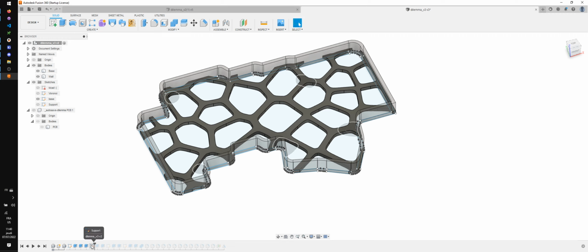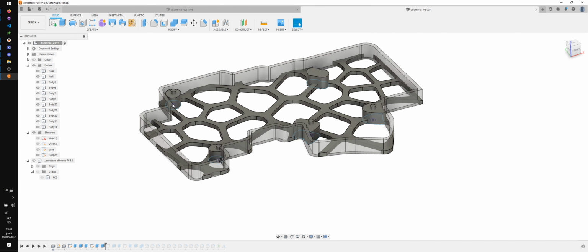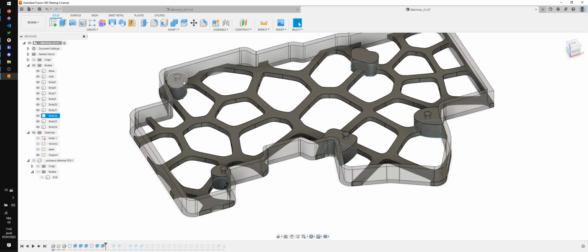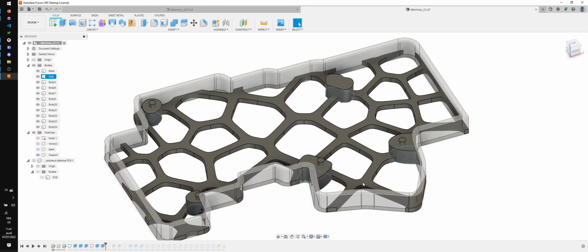All right, then new sketch, which is called support, and that is for those. All right, so there's a few things I don't like here, which is when I was installing the PCB, you have to press on specific points, which is 1, 2, 3, 4, those 5 points. So it's not super convenient. And also, it means there's only so many supports. And when you type, there's a possibility that the PCB will sink. Mostly here, this top left corner, this top right corner, and bottom right corner here.